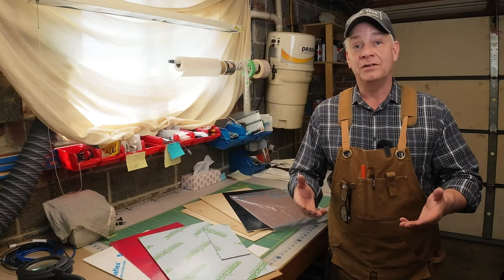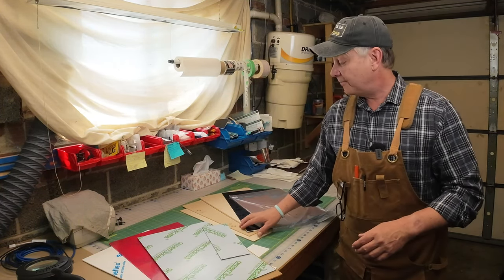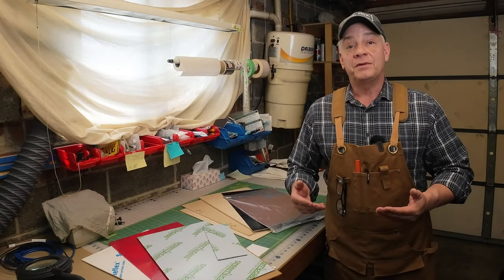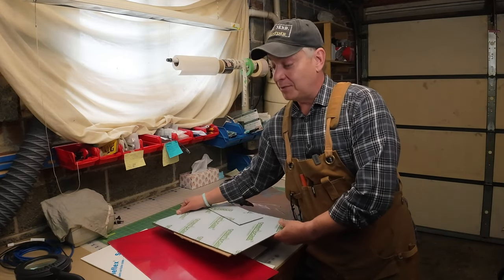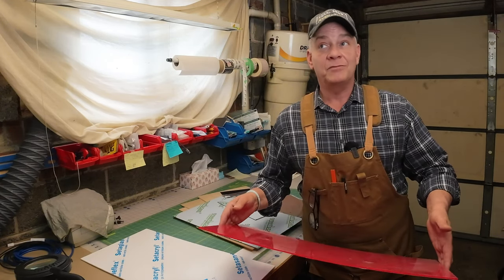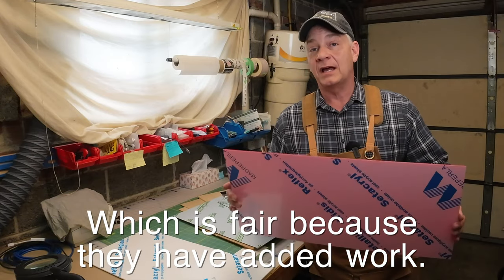There are a few things I wanted to pass along if you are new. When it comes to flat materials such as MDF, Baltic Birch, craft plywood, Rowmark, acrylics colored or otherwise, leatherette — there are only a few suppliers I found. What I'm finding is that in most cases the supplier will not provide a 12 by 20 sheet, and if they do, it's because they charge you cut fees to cut the board down. Your acrylics or plywoods often come to the supplier in a 24 by 48 inch sheet, so they'll sell you a full sheet, half sheet, or quarter sheet — your quarter sheet being 12 by 24. One supplier will cut it down for me, but they charge me a fee. This is my point about that simple feature the Bolt has: you save that cut fee by just ordering the quarter sheet and cutting it off.